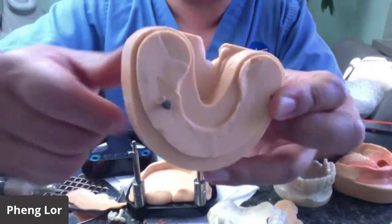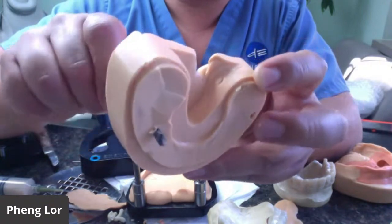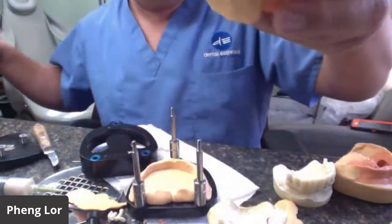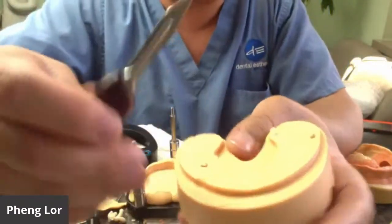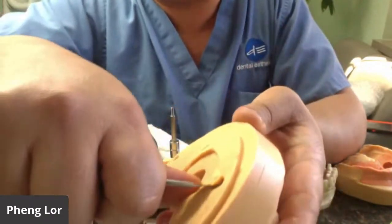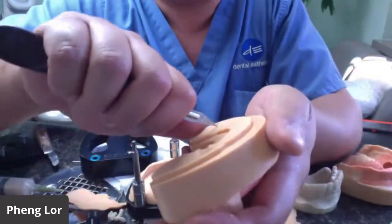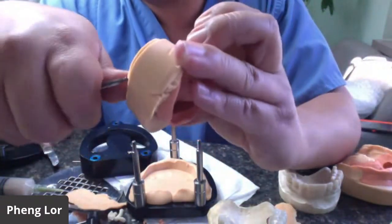I'm actually going to inject. And I saw that on that side, you held your index finger to feel where you could feel the drill going. Yep, that's just to make sure you're at a good location for injection. Got it. And now y'all can see all those little shavings that came out. You've got to make sure nothing's stuck in there. And you're going to make a little reservoir, basically, for the excess material? Yes. That's where the pressure pot can take that excess material. It's got something to work with to push down and compensate for shrinkage.